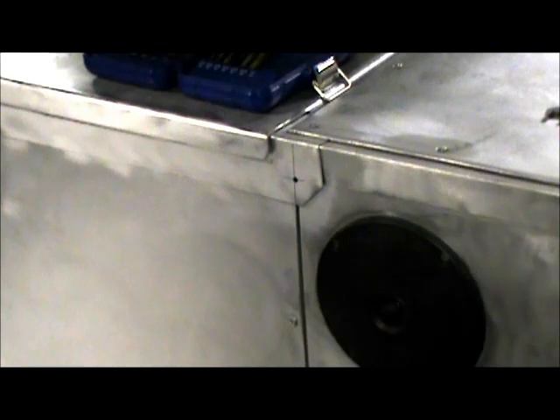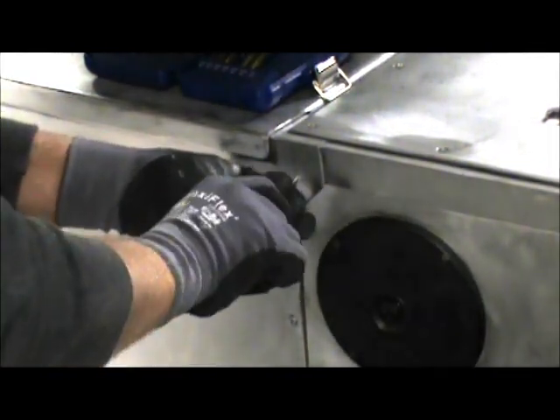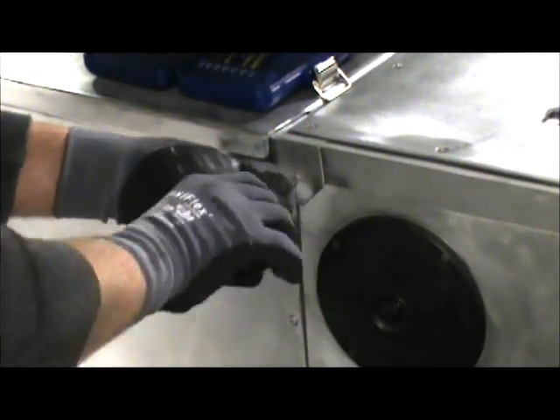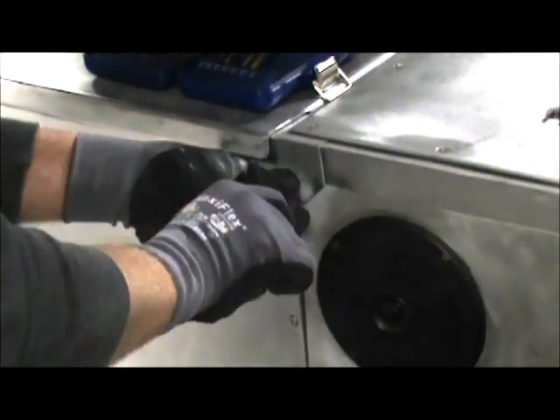It only takes moderate pressure as long as your drill bit isn't completely dulled down. This is the tap and the T-handle — I'm going to insert those into the drill opening, apply gentle pressure, and get it started into the opening. Don't force it.